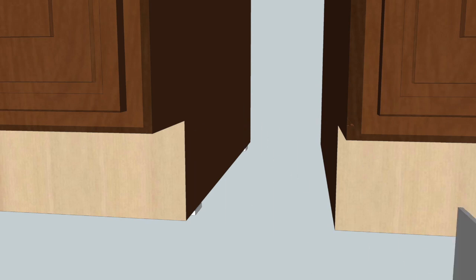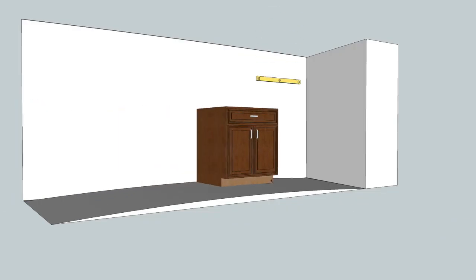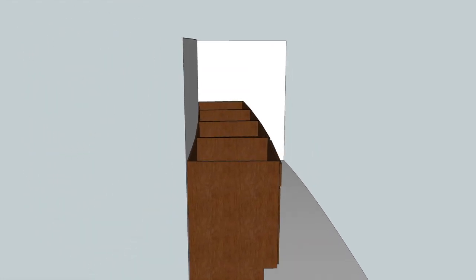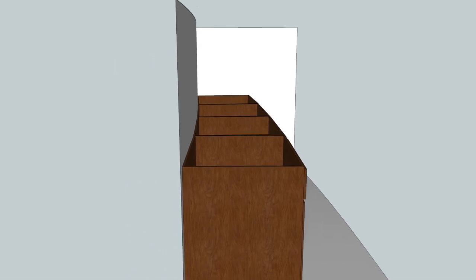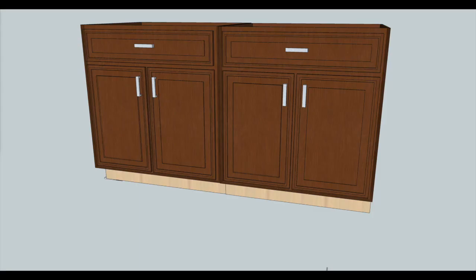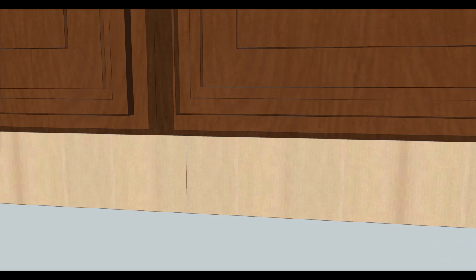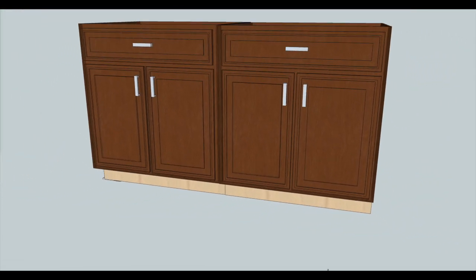To fix this, we're told to cut off the excess, create a second shim at the exact same height, turn it the other direction, and carefully set the neighboring cabinet into place. As we're busy installing and shimming our cabinets one at a time, our cabinets are going to follow the imperfections of the room — the walls and the corners. Slight imperfections we won't notice until face frames are no longer lining up. Shimmed cabinets cannot be moved at all, so micro-adjustments are nearly impossible unless we first remove the neighboring cabinet, reposition the shim, and move it back into position.